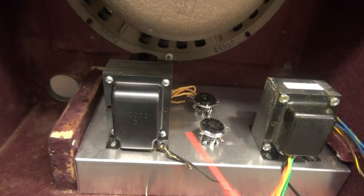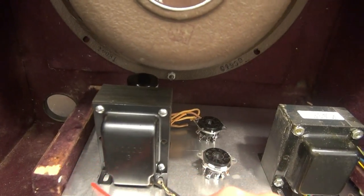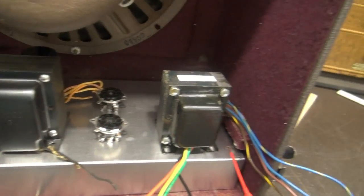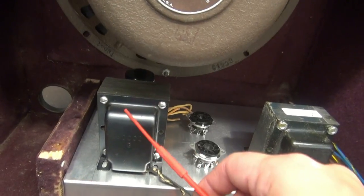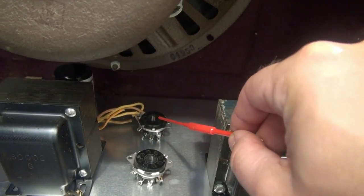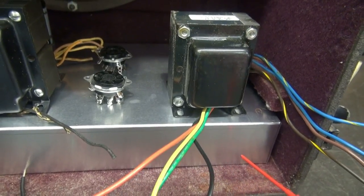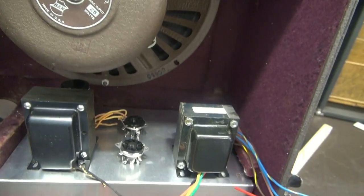Here's the chassis layout. I made sure to leave a 1-inch space on both sides for those wood blocks that will be holding the chassis in place. Here's the power transformer, there's the output transformer. This will be for the 6L6, and the preamp tube will be up there. Hiding over here is the filter capacitor. AC will come in here, switch will be here. I have jacks here for 4, 8, or 16 ohms, and the internal speaker is going to have a pigtail that plugs into the 16-ohm jack.